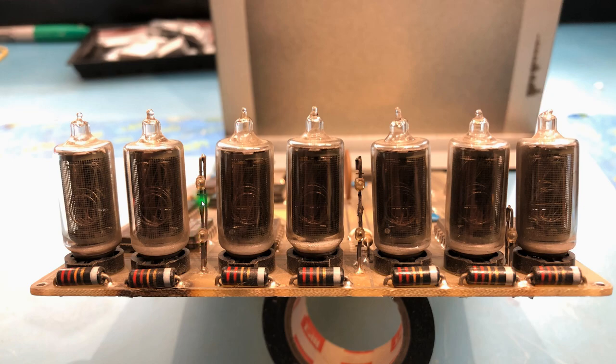What's interesting is they've taken two of these devices, soldered them together, started the lead, then dropped it down the back, making a little loop. There are actually three leads going to the board — a middle lead that comes off to the PCB — as if these could be blinked individually, maybe for AM/PM indication. There's also a decimal point here. So we have hours, minutes, tens of seconds, seconds, and tenths of a second. This can display 0.1, 0.2, 0.3 seconds, and it just screams to be turned back into a clock.